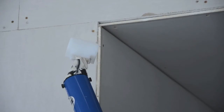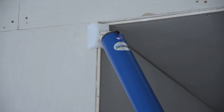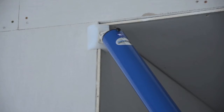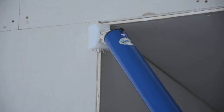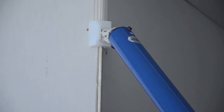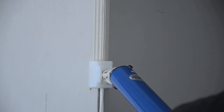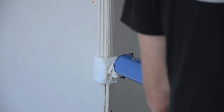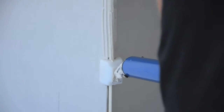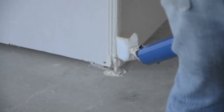Make sure you turn the gooseneck into the corner — you can see the gooseneck is a different head. Onto the corner, make sure you're seeing it correctly. Apply slight pressure on the plunger of the applicator tube until you see the mud coming out. Then gradually come down, and you can actually see the perfect mud layer on the external itself. As you get lower, roll the head and twist it so you get the application of mud in one hit.